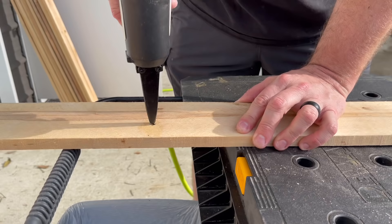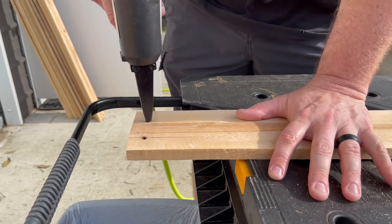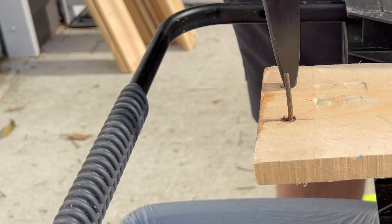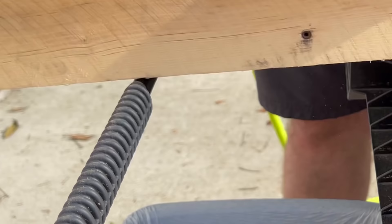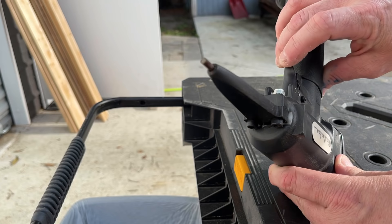Now to deal with those pesky nails — this thing is amazing. It's a pneumatic tool called the air locker. I'll link it down below. You put the tool with the nail up inside it, and then a piston drives the nail out. I like to do this over a trash can just to keep the nails from getting everywhere. Now, you might be thinking why would you want to drive the nails out when you could just cut the ends off? Well, the ends are one thing, but the middle portion is another. Getting the middle nails out with ease is fantastic.